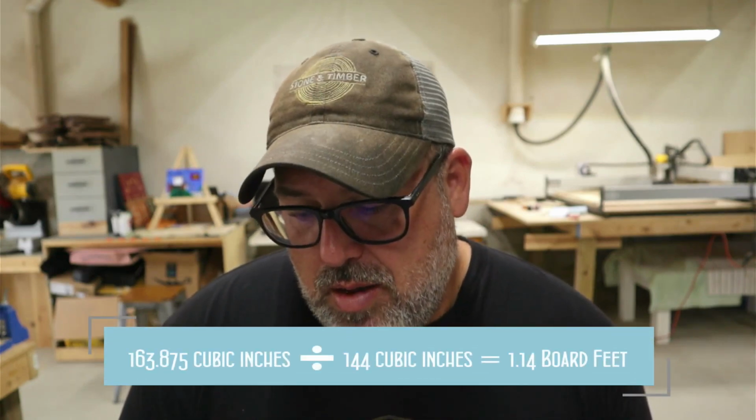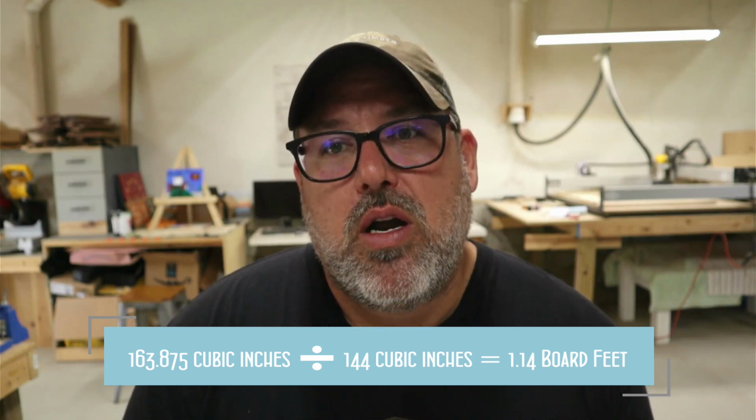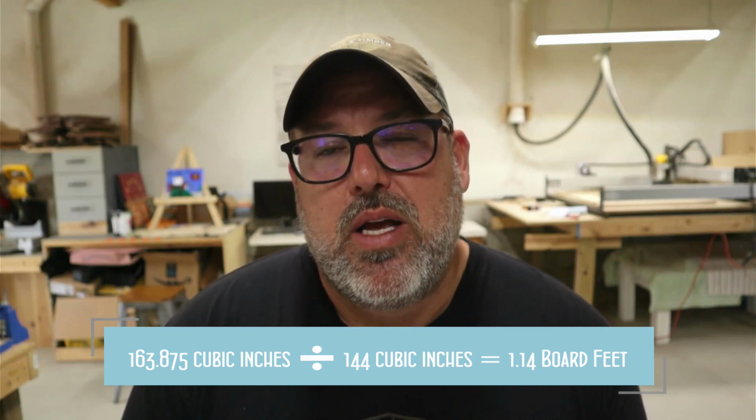So if I take that number that I have, which is 163.875, divided by 144, I come out to just an extending decimal number here, but we're going to round to 2 decimal places: 1.14 board feet in that board. Now, you're going to ask, what does that tell me?